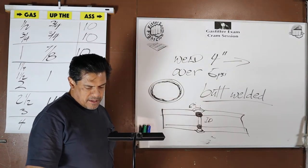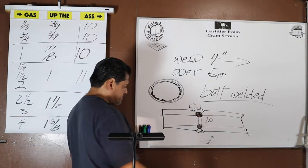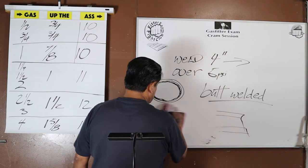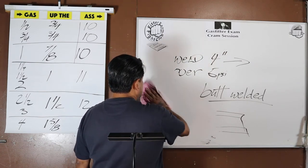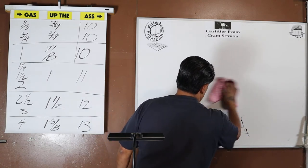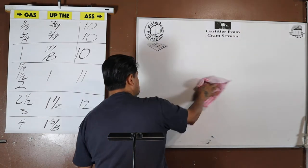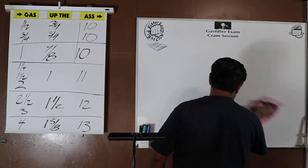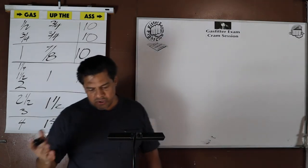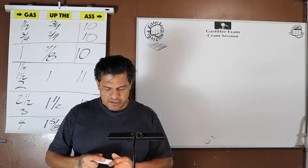The following piping material shall not be used. This is worth writing down. Now, first off, we are definitely using carbon steel and wrought iron. In fact, that's pretty much all we're using. That's pretty much all we're used to using. Black steel. Wrought iron, again, I said, you can use it, but it practically doesn't exist, okay?